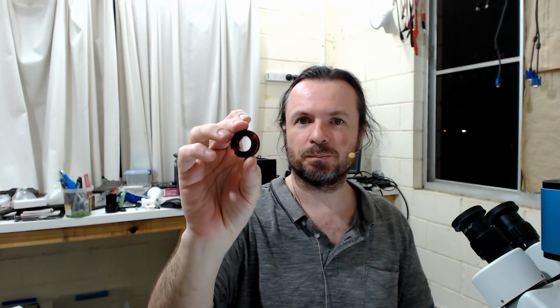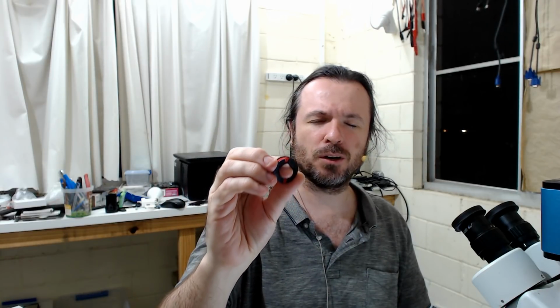I did get something interesting come in today. For a while I've been after enamelled wire, and I can get 0.02, which we use for things like touch disease connector, the M1 fix and stuff like that. And then the other stuff I can get is about 0.1 mil, which is a little bit too thick. It feels like a whopping great big girder on the boards, which is what a lot of the cables out of the battery flexes and whatnot. But I found this stuff, and this is actually crystal radio isolation wire. It's antenna wire, I believe, but it consists of multiple strands of 0.05. So it's half the size of the stuff I'm normally used to. So I'm going to give it a go.